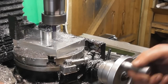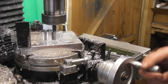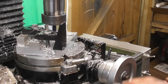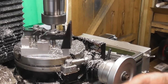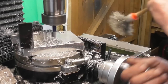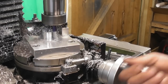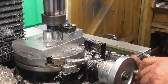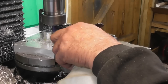You'll see when it comes round here that I've dug in right round and into that area there, and I've just undercut that face by just a half mil, because there is half mil left on that face. So I'm going right round. I should, when I hear the squeal, that's the spot. Back round again. To my zero mark, which is there. And just, I'm touching. That's it. No more. Final cut around this radius.